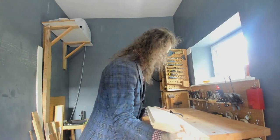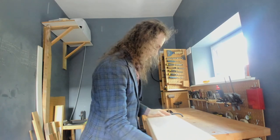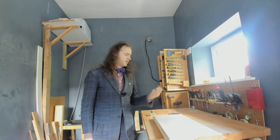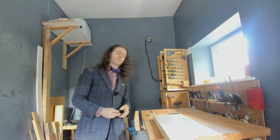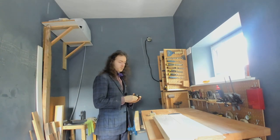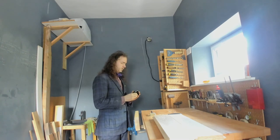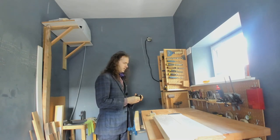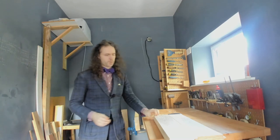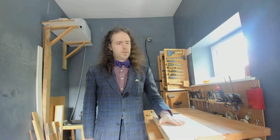If I was working on walnut I'd have to sand it down, but because it's such a beautifully straight-grained wood it just goes really smoothly with the router plane. No wobble — none at all, not at that end so far. Flushed the bench all the way along. If I flip it over — flush all the way along that side too. So the router plane gets you out of a few tight spots. I couldn't have done that with any other tool, apart from maybe a table router. Even a hand-held router I would have struggled with because it's such a small space. That's how I fixed that.